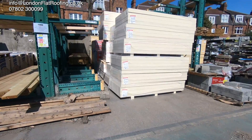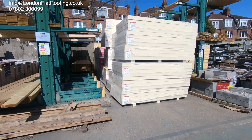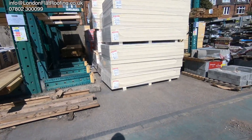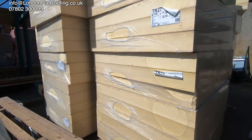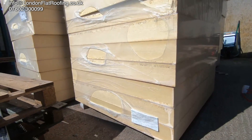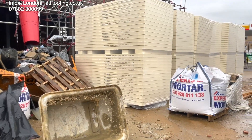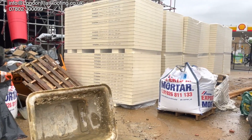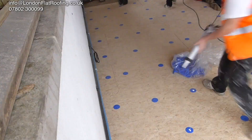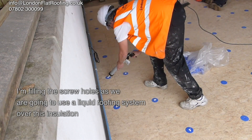Look at this - this has been left outside. To me, it hasn't been left outside for too long because it's still quite bright yellow, but it's still been left outside. If we look at this one - dark yellow - the UV rays have got to it, it must have been outside for a long time. We even look inside the plastic here and you can see the moisture that has built up inside it. The lessons I take from this are: make sure you always take moisture measurements from your deliveries, make sure you store everything well and in the dry, and always fix everything with thermally broken fixings whenever you can, because you can always trust those.